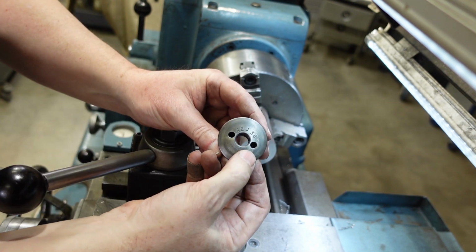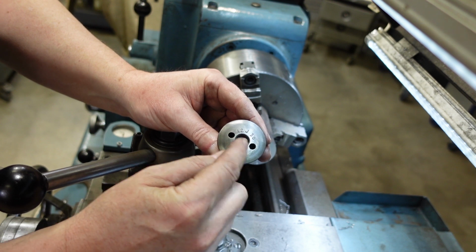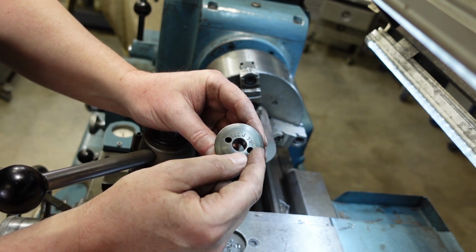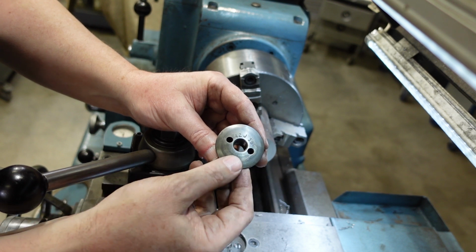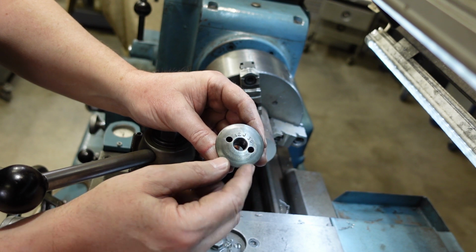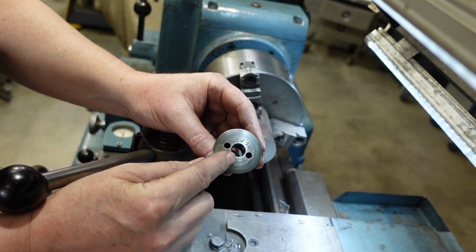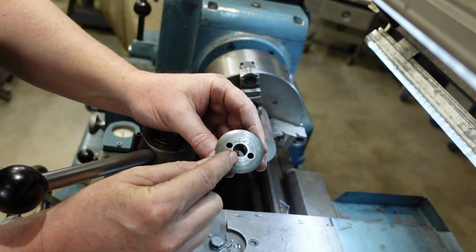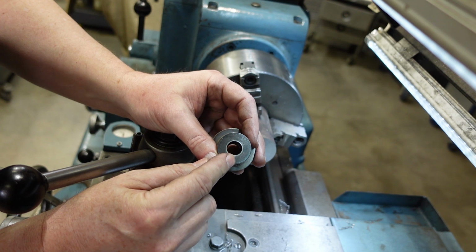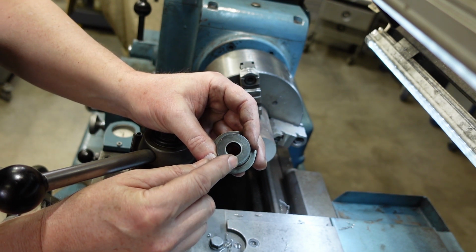To get these on and off the rolls, you use a pin spanner, and that's a 7/8 centres there, with those holes measuring 7/32, so that's the size it is. But that thread is actually a 1/4 inch BSP. Why they've used it for this, I don't know, but that's what they've done. However, on the back of it, there's a counterbore, and I think that locates on the shaft to try and get a bit of concentricity, a bit of a register.